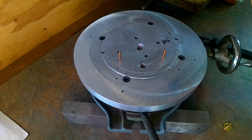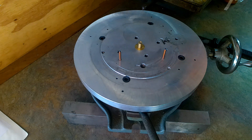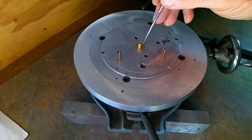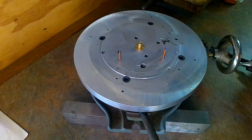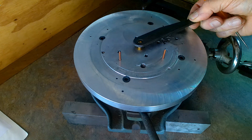I've then got a tightly machined plug that fits in that concentric recess — it's got a reduced stem as well, so it's a nice location fit. Of course, you've now got something you can indicate on. Also, if your part has a hole that needs to be on center, you can ream your hole to whatever size you've made this plug and use it for location. For example, if you wanted to make a part with a hole and a radius on the end, it would go over the pin and be clamped down, concentric to your pin.